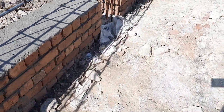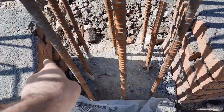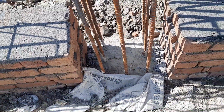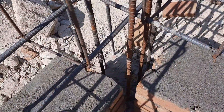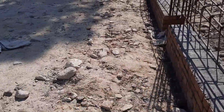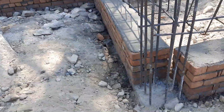The span between these two columns is about 20 feet. As you can see, we have three steel rods at the top and two at the bottom, diameter is 16 millimeter. The size is 18 by 12 to 14 inches. After fixing this plinth beam, they will provide on the top of this plinth level — span is 20 feet. This is a four-story commercial building.